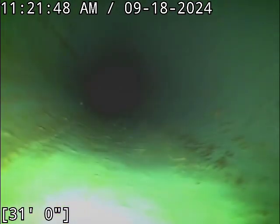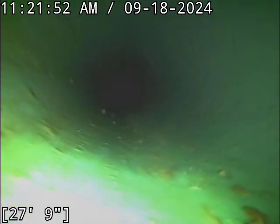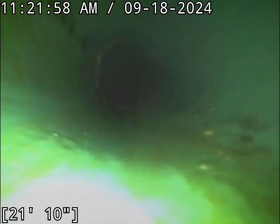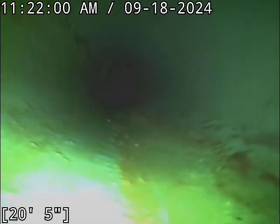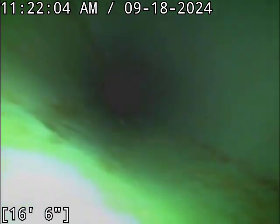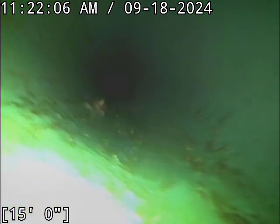And it's a hard spot to visually watch for diameter. I want to say that most houses in Canby transition to 6-inch pipe by the time they get into the PVC portion of the line that we're in right now. When you have standing water like that, just visually speaking, it's hard to watch for the diameter change. It's either 4-inch or 6-inch. I believe this is 6 though.